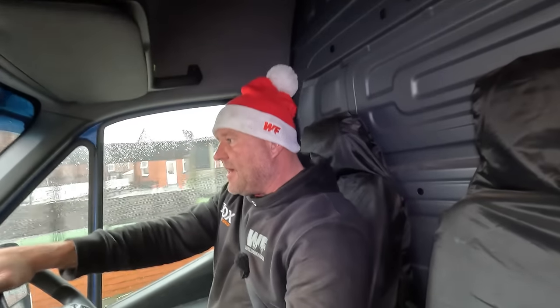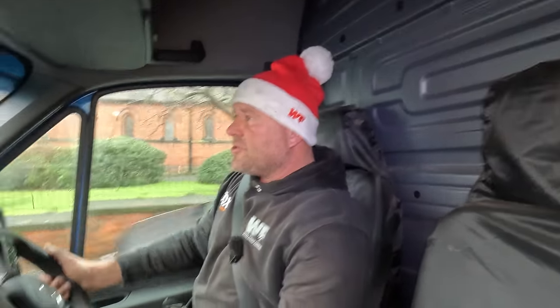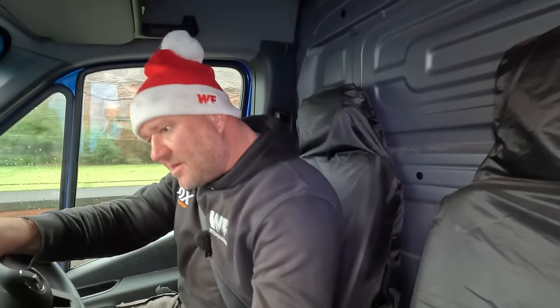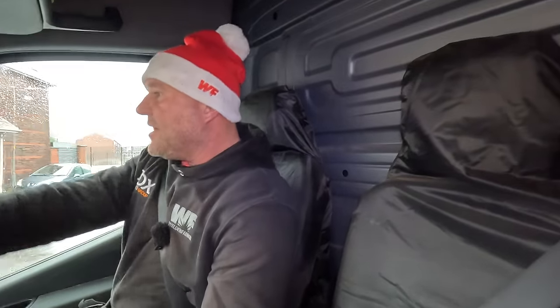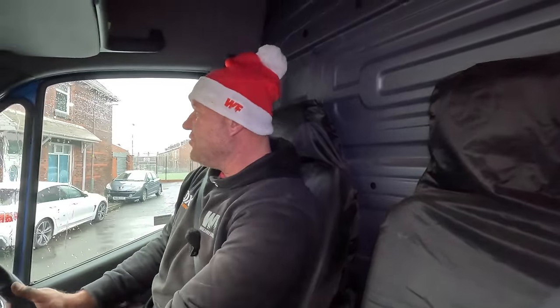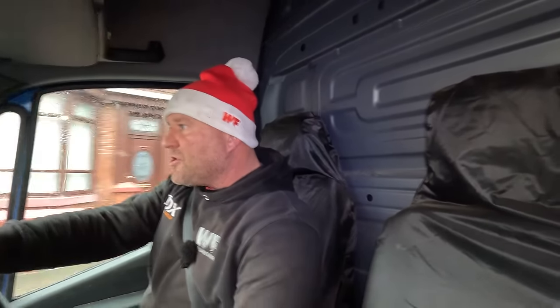So that were our Finchy boy there, Dave Finch. And I thought we'll just take a step back on what he just said about a grease gun, because he's got a good point, really. If they all had electric grease guns like us fitters have got, it would probably save a lot of money in the long run on bushes and so forth on machines, and they keep the tracks pumped up to the right tension.